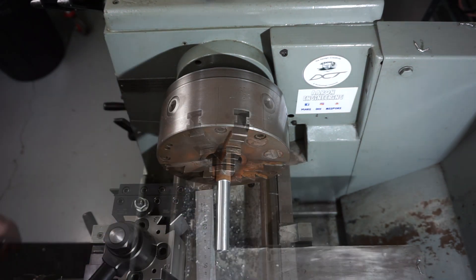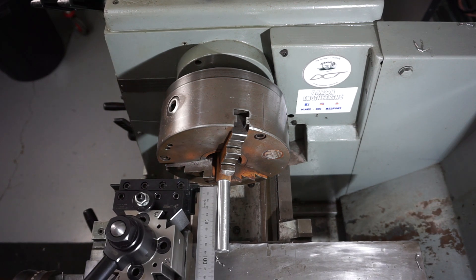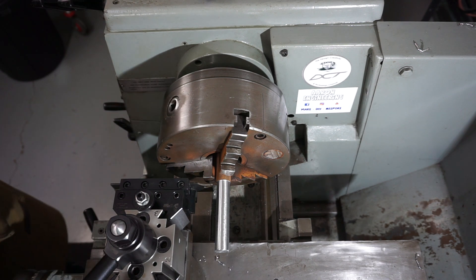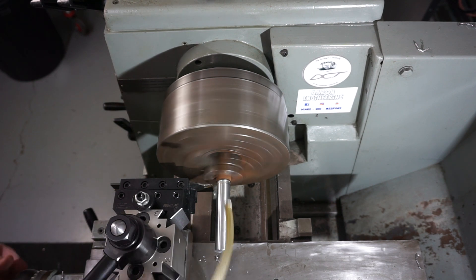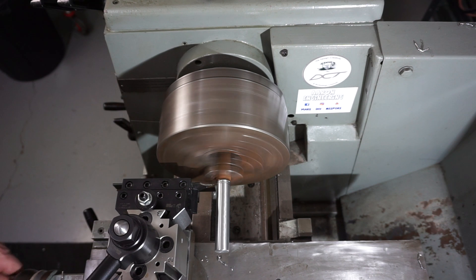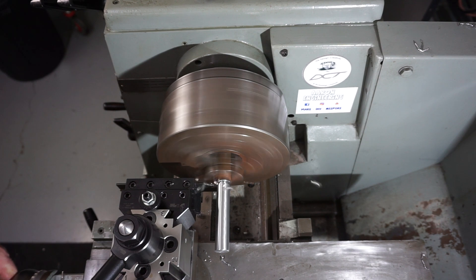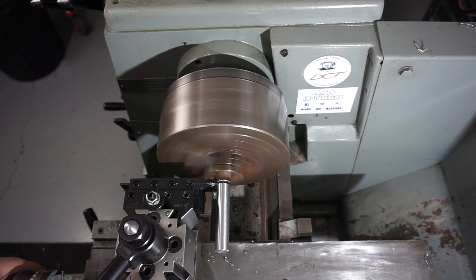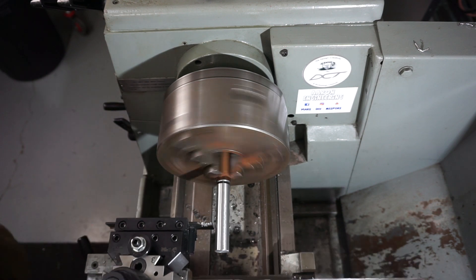What I'm going to do now is part this off ready for the correct length of the stud, and then I'll thread it once I part it off. This is just a carbide insert — I believe it's an ISCAR tool and it's really nice. I'm parting off here at about 800 RPM. It's a little bit slow but it has no problem going through this, which is just pretty much mild steel — like a hot knife going through. I didn't part all the way off; I just decided to leave it there and break it off with my hand.